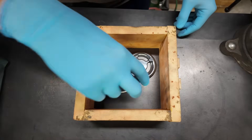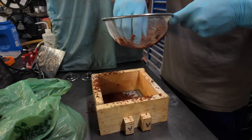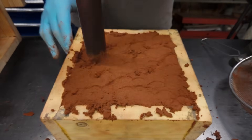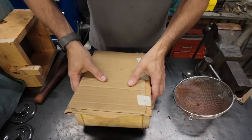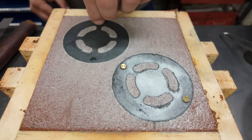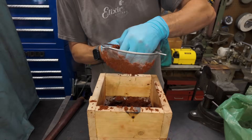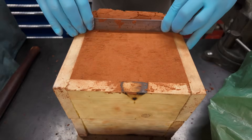Now that I have my pattern ready, I'm finally ready to start ramming up this mold. In the interest of full disclosure, this is only the third time I've actually tried casting something, so I definitely don't have a lot of experience. Everything I know I've learned by watching other people do it. This part of the process is always a bit stressful because there's a lot of work involved and it's really easy to mess up. Things seem to be going pretty good so far — I have these little registration holes in the two halves of my pattern that take quarter-inch pins and allow you to register the halves correctly so they don't move around when ramming up the mold.